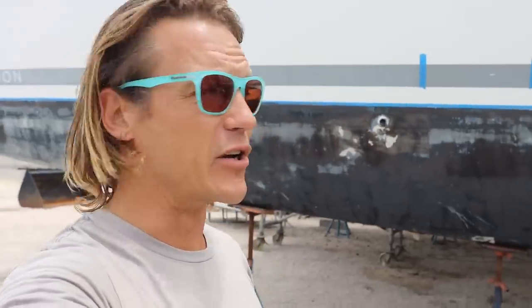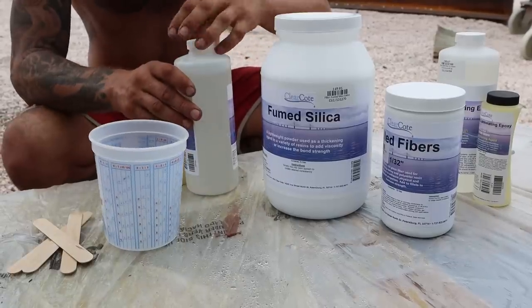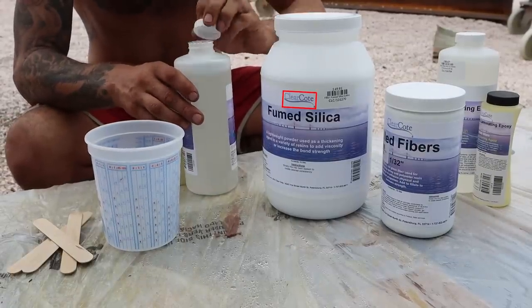What we want to do is align this thing perfectly straight forward and aft with the water line of the boat — right here with the black line. We're going to epoxy these in, and once it's all straight we'll fair it all and it'll look really nice. First things first, let's get some epoxy mixed up.